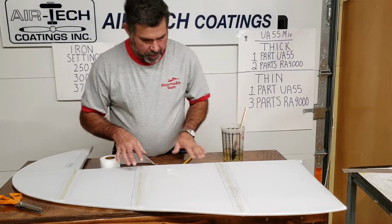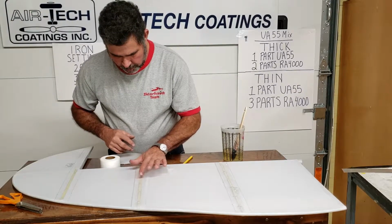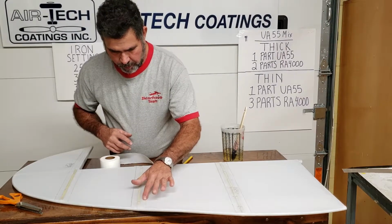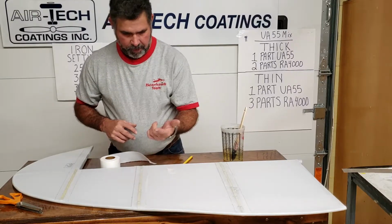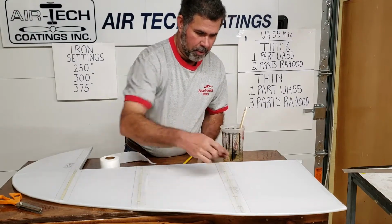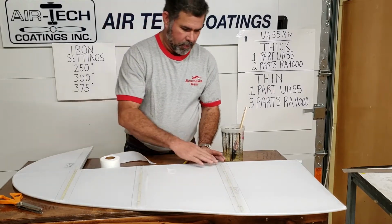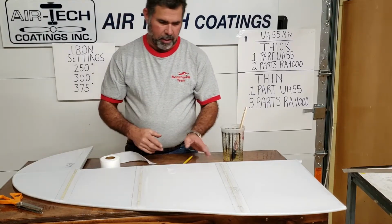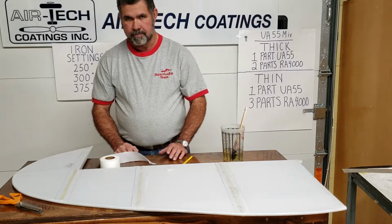And I can see the difference in those two. This one is rubbed down a little tighter. This one has got a few more hollow spots, or I say hollow spots, light spots. Now see, I can rub my finger, and those spots will flatten on in, and it looks like they're all going to lay down good, but now I got glue on my finger. I didn't have glue on my finger a while ago because I laid the dry tape in the wet, rubbed it in, then brushed it in. So I like this way the best. You don't get glue all over your hands, and you're able to sit up here and really rub it around these to where you can do this way, but it's just another way to do it. This is actually in the manual. I ain't saying this is wrong, but this is the neater way to do it.